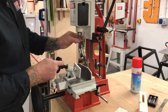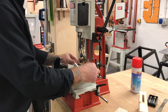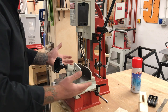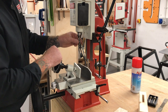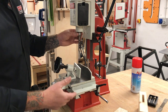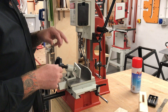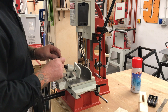What I'm looking to do next is get my chisel square to my back fence. On this particular machine the back fence is adjustable — it comes square out of the factory but might get bumped or banged. The important thing is that each time you change your mortise chisel for a different size — these come in multiple sizes: 6, 8, 10, 12mm or imperial equivalents — you check the square. This machine will take up to a maximum of 16mm in softwood, not necessarily 16mm in hardwood.